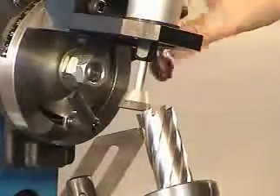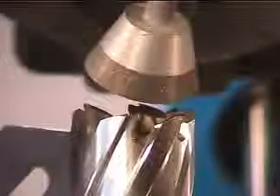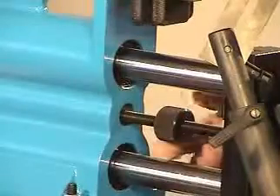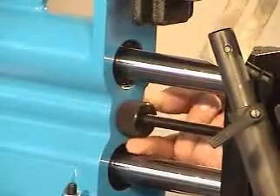Move the motor into position by adjusting the vertical and horizontal slides. Position the grinding wheel just above the tooth and center the cup wheel with the center of the tooth to be ground. Adjust the feed rod adjustment nut on the feed rod so that the chuck and cutter will only be allowed to move enough to cut the tooth. Check all teeth prior to proceeding.